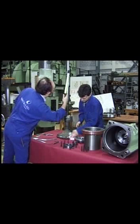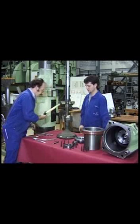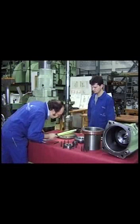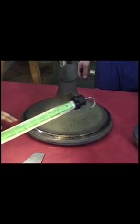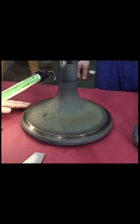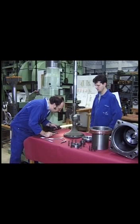After a preliminary cleaning, all valve parts must be carefully inspected and measured, and all measurements compared with the values stated in the clearance tables. Signs of wear, especially on the sealing surface, must be recorded.